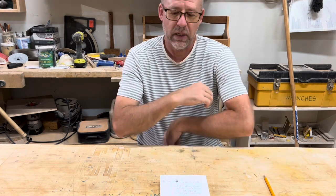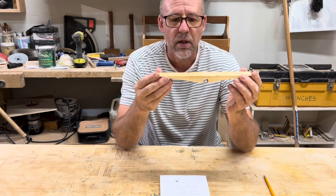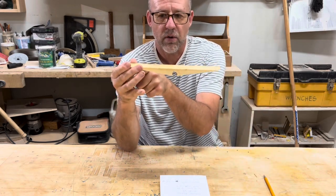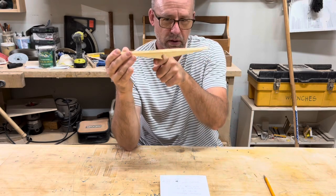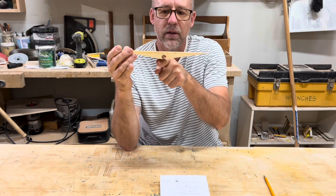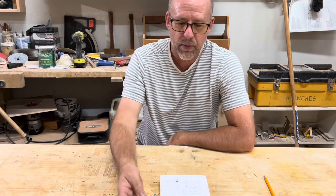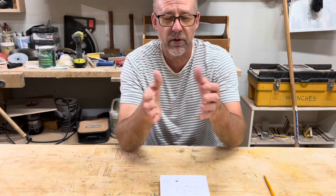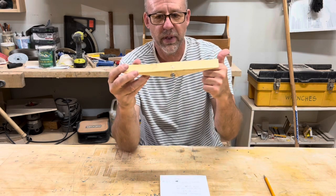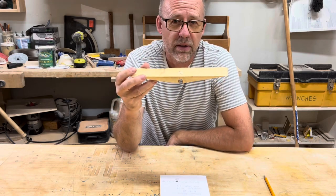So let's get to the subject at hand. This is a double wedge-shaped hull, and I've already tested this in the water. If you get it to a certain velocity, the water will deflect downward off of here and it will not be able to rise. Water travels in a sine wave — once it leaves the transom of a boat, it goes back up and then it goes down. Once the velocity reaches a certain point, it cannot reattach to the surface. So there's a point on a ski boat where the transom becomes dry — it starts out wet and then becomes dry — and that has to do with the speed of the boat compared to basically the speed that gravity has on the water.